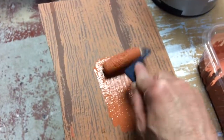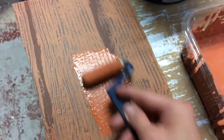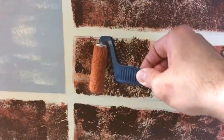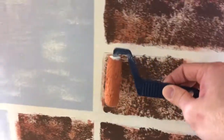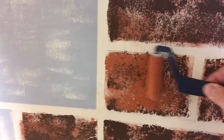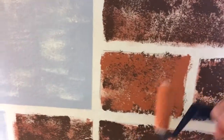You don't need a lot of paint, but you also don't want to be too skimpy — you do need a moderate amount on the roller to do the job. So we're just going to come over here and do a brick. You want a nice light touch; the idea is not to push deep or hard, you just want to skim that brick, and what will happen is you'll start to lay off some of that color because the roller itself is textured.